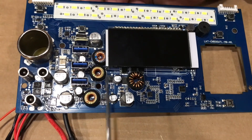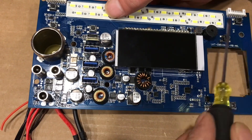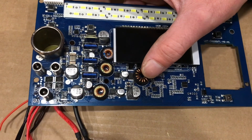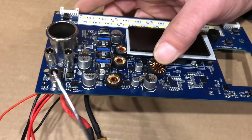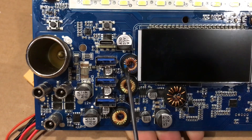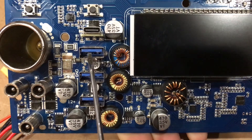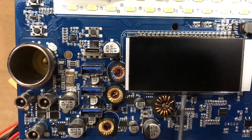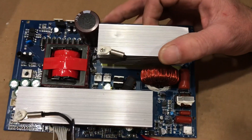This board I'm going to call the user interface. This is the display and all the buttons on the front that correlate to the front cover — so just calling this the user interface board. There's your cigarette lighter adapter and all your 12 volt stuff. And remember the XT60 on the inverter board — here's the actual beginning of that XT60, where your solar or wall charger input positive feeds back down to that inverter board. All these little transformers actually take the 12 volts off the battery and put it on the DC power supply for these USB ports at 5.2 volts — just dropping the voltage down for all your USB stuff. From what I can see on this board, there's no control logic in the user interface board — everything is back in the inverter board.